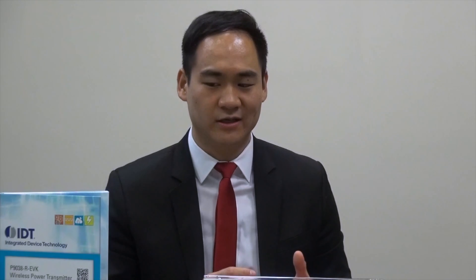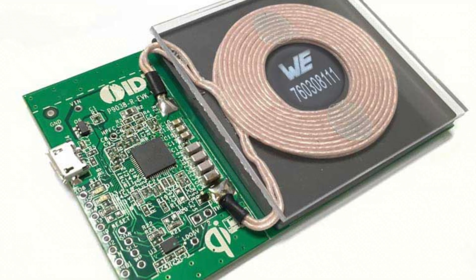They're also built to the quality standards expected of a German company. Litz wire is utilized throughout the construction as well as high permeability core materials to yield the highest Q-factor coils possible on the market. Also on the transmitting coil, we utilize a special pot core design to minimize all the unwanted stray fields within the coil.